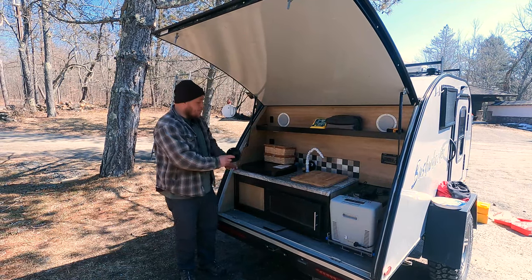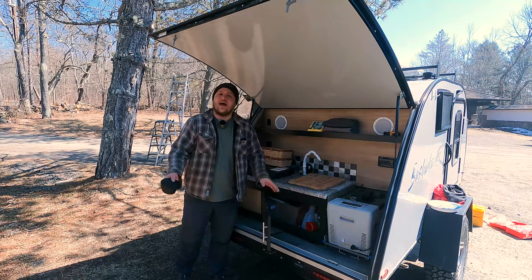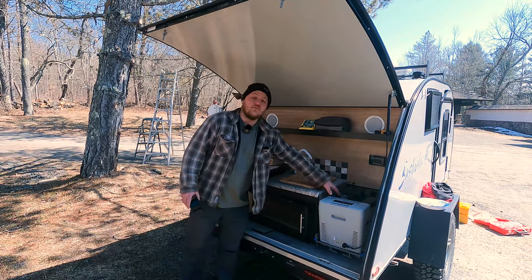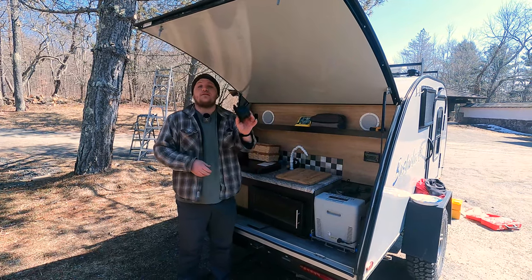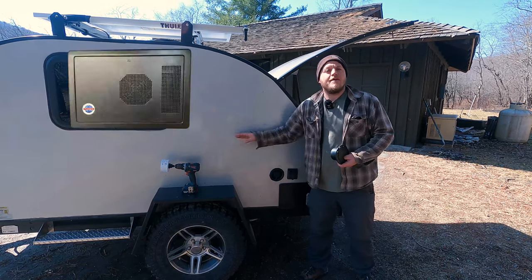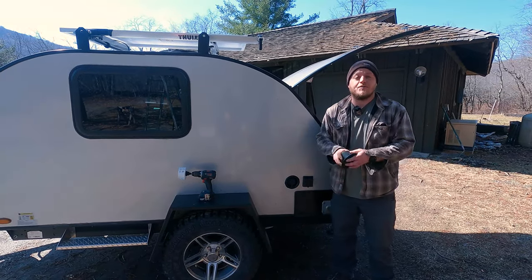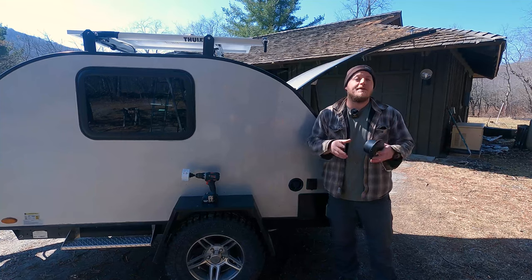This is going to pass the interior portion of the cable entry inside this base cabinet, so when I run a wire through it'll be inside the cabinet and out of the way. I could cut a hole through and put some trim pieces to pass the wire through, or even just use the cabinet door. I could place a power station here, run my refrigerator on it, close the galley door, and still get a solar charge. But there's one more reason this is ideal: my load center and converter are right here, meaning all the wires going inside my camper come back to one location. If I want to tinker later, install an inside charge controller, I'll have this pass-through right in the cavity where all the camper's wires run.